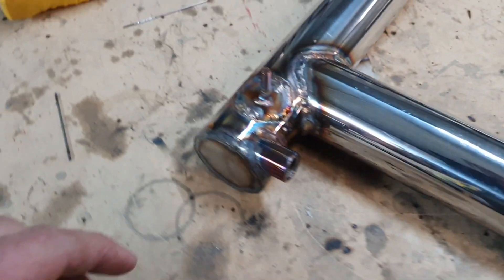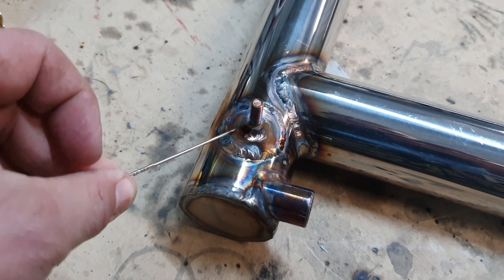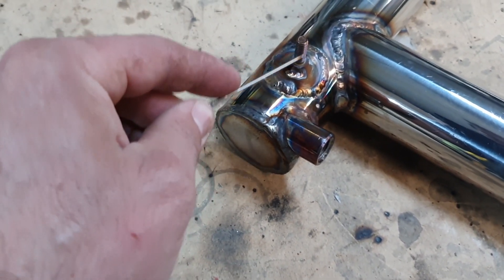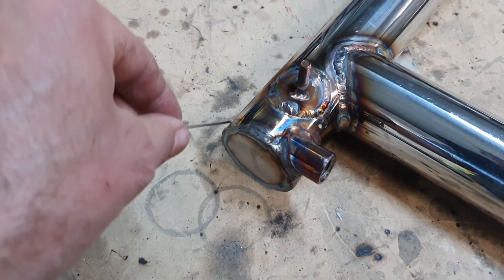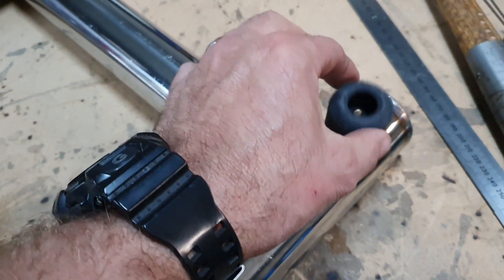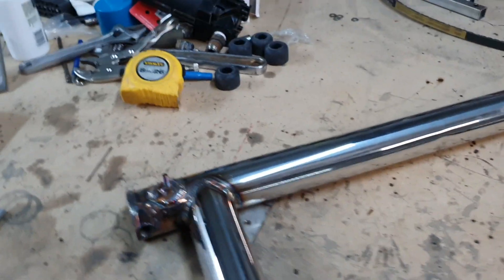You would have watched me just make these little dookies - I'm not going to touch this because it's actually hot. These little plates are actually the holes I cut out of the pipe where I used the notcher. I welded the bolt to those and then welded them all the way down. That way this won't fatigue on the tank itself - if anything it'll fatigue this little piece, and if it does eventually crack it's not going to create an air leak. I did four of those, one for each corner, and they of course have our little mates sit on them with a couple of washers. So we have some rubber feet on the bottom. That's all put together now.